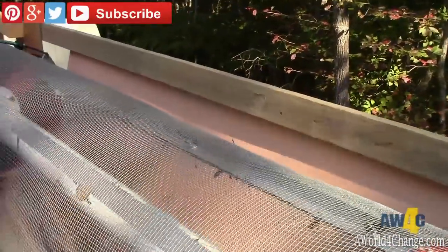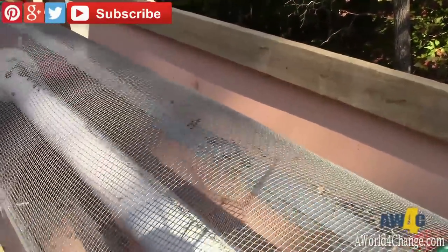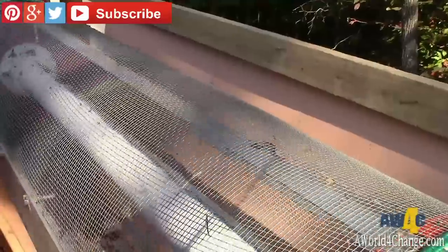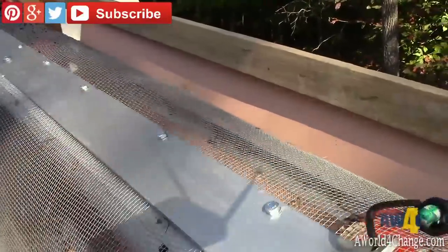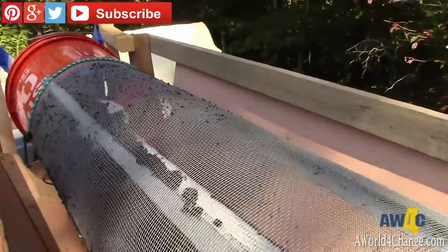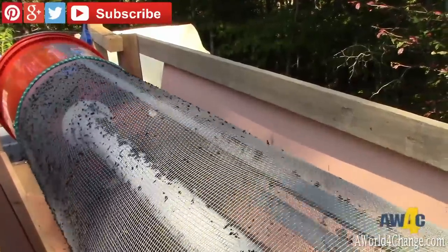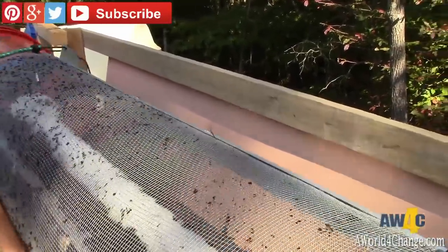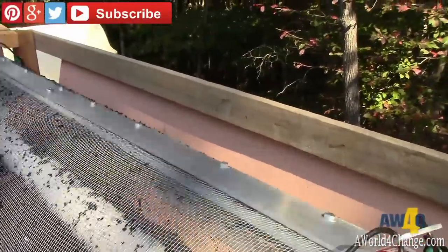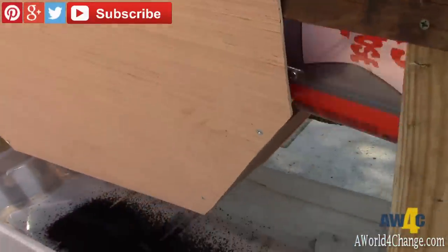I'm going to give you my view of what it looks like as the red wigglers start to come down the screen. I'm just going to turn it real slow for you so you can see how it works. I've added angle iron on the inside so that it makes the material fall kind of like a washing machine or a dryer — the paddle's on a dryer drum. That's really the purpose of those. And you can see here as I continue to crank, this is a very moist worm casting bin — I've been keeping them very wet. As I continue to crank, you can see the worm castings start to fall down and underneath the hopper.